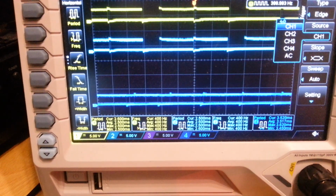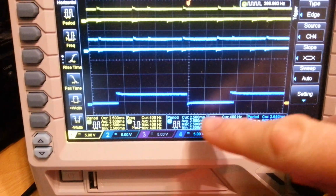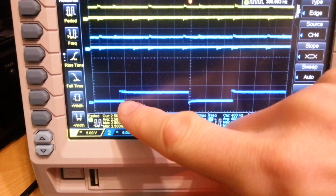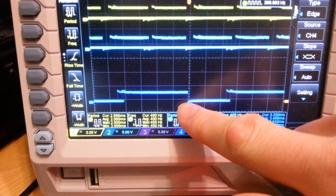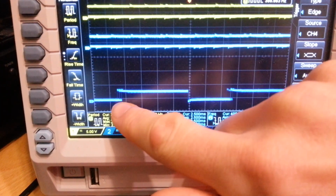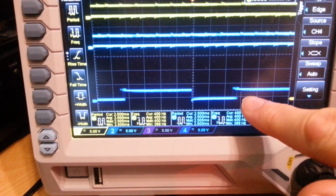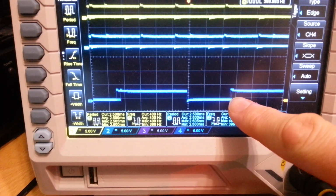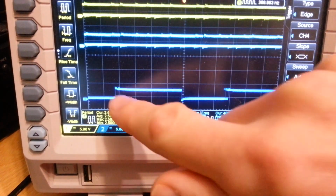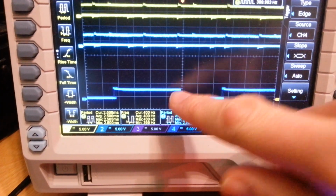and update the edge detect to be on the fourth one. So what we can see down here is when the main loop starts, and this is when the motors have been written to. So what we can see here is the amount of time it takes for the main loop to start and restart is different every time, which is why the signal is wobbling about on the scope here. And we can also see that the time here and here is different as well.